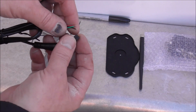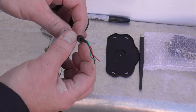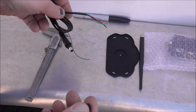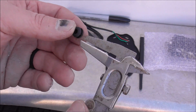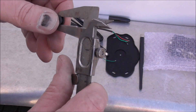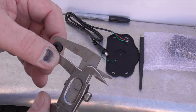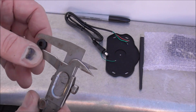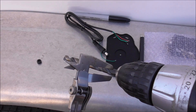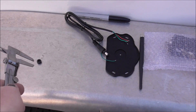Let me show you how I figured out what size grommet I needed. I went through my grommet assortment — just an inexpensive Harbor Freight grommet kit — and found a grommet that fit neatly over the wire without a lot of gap, because I want to be able to caulk around it as well. To figure out what size hole to drill, I just closed this little tool down on the grommet until I had just a little bit of play all the way around. Then I went over to my drill index and found a bit that fit just like that — so I know this drill bit will work perfectly for that grommet.